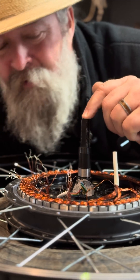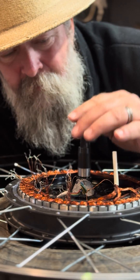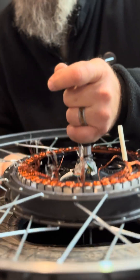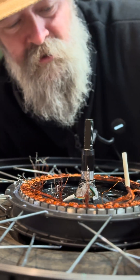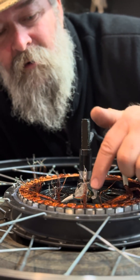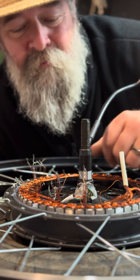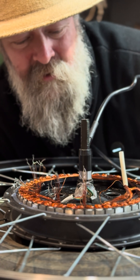What's going on is it needs the other cover in order to hold this suspended, perfectly centered inside the magnetic ring. My plan was to mount this on something where I could spin the wheel and the shaft would stay fixed, but the problem is you can't move it because the magnets pull one side and then there's an insane amount of friction. So what that means is I'm going to have to do all the soldering with this enameled wire and bring every single wire out through the hub where these wires come out. I'm going to get rid of these and do the wiring externally. That's the only way we can do this without building some kind of custom bolted-on pseudo hub to hold this axle in the right position.